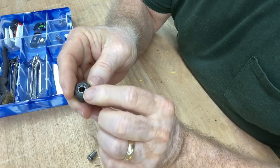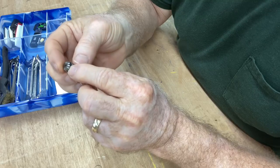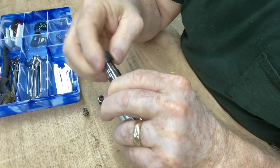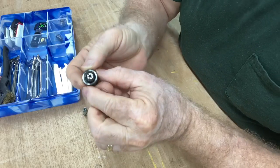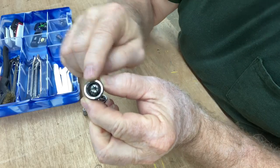The question is, how do you get the collet out? It has a ring inside that holds it in place. I'm going to take off this nut — you can see it moves fairly freely — and there is a ring right down inside that actually holds the collet in place.